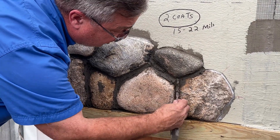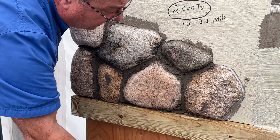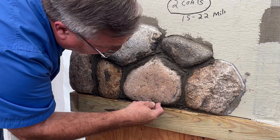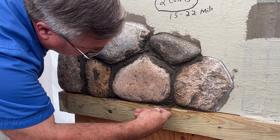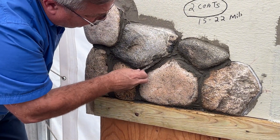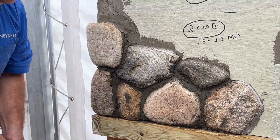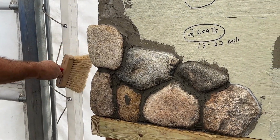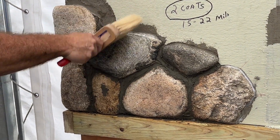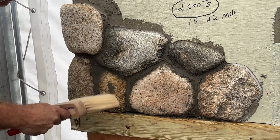It's really easy to use. You could not use the high bond for jointing — you need to use the pointing mortar. We don't want the pointing mortar to touch this wood. We've got kind of an odd joint here — we'll deal with that later. Those are done. The very last step is we're just going to brush finish this, brushing away a little bit of the excess mortar.